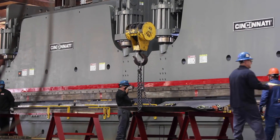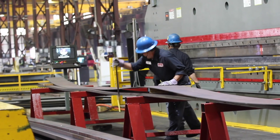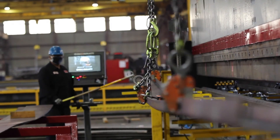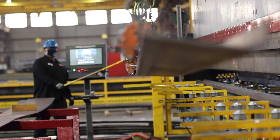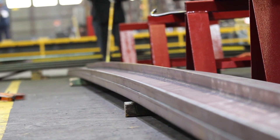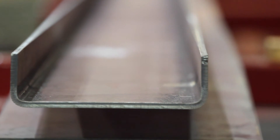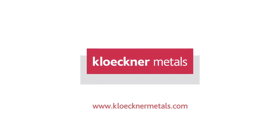We're what is known as a one-stop shop. We have raw material here in coil form, as you can see, and we'll level it to the required sizes so we can put them on the burn table. Our burn machines are also 50 feet and longer, so we can burn long parts as opposed to many short pieces to make an item, and then we'll form it all in one piece.